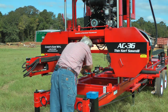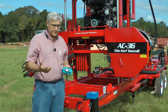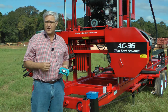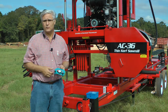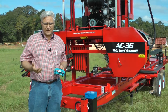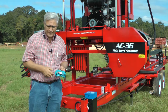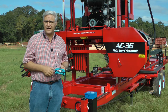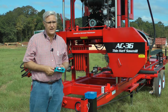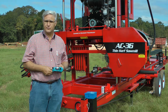I'll take this off right now. It's a real simple, easy instrument. As I mentioned in the last video, if you're breaking blades you can back off on your tension a little bit — that's one way to know. The tighter you can have your blades the faster they run, up to a point, but you can start breaking blades. If you're having trouble, just back off a little bit. Without one of these instruments you don't know exactly how much pressure you're putting on a blade.